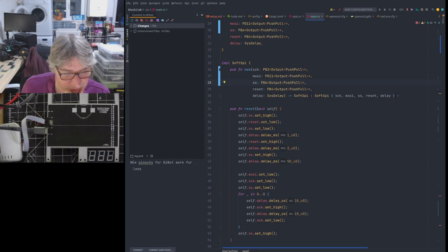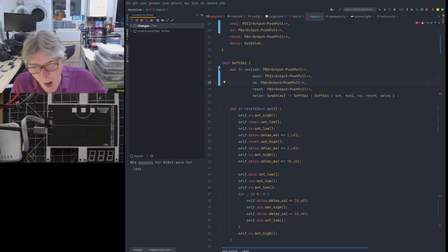Yeah, I have seen that before. Very fancy. Again, I'm not sure how well that would work on these tiny pins, but maybe. It's quite difficult to clear. You can suck up most of the solder, but you've got to clear it well enough so that the pin isn't stuck internally or on the other side. If you looked at the solder for that connector, it went all the way through. So there was solder on both sides. So it would still be very tricky. But yeah, I don't do much desoldering, to be quite honest. Not of that skill. It's probably not worth me investing in that at the moment. But yeah, nice option to have.